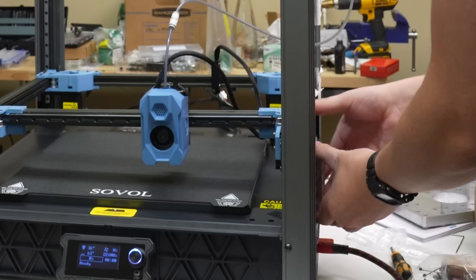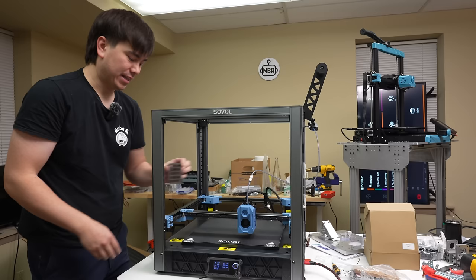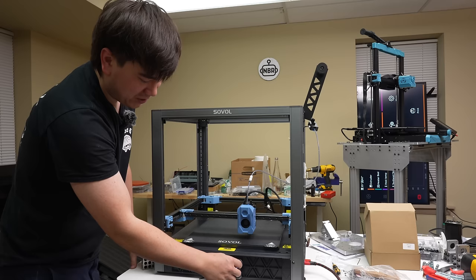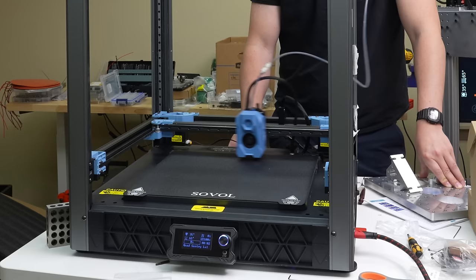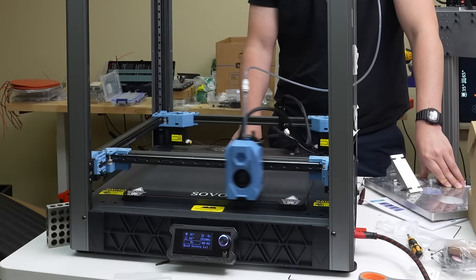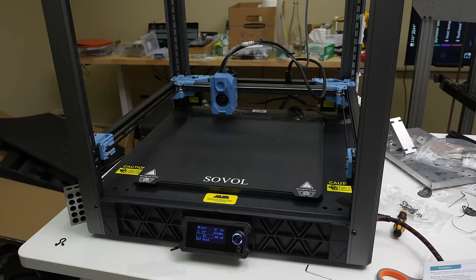It's a little bit higher on the left side than the right, so I'm going to manually level the gantry. With that manual leveling — basically setting something under the gantry at all four corners and pressing it down — the bed should be relatively level. Let's retry those operations. The gantry was just too far out of square to get everything working properly, but now that we've done that it should be fine. Now it's printing — this is after doing the nozzle offset procedure, and we'll take a look at the results.